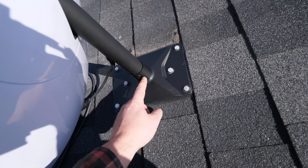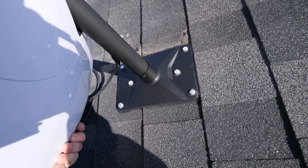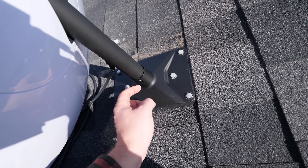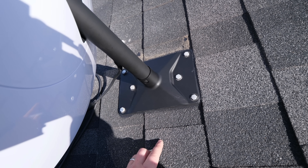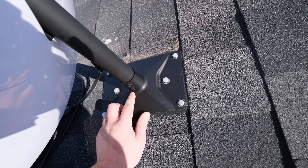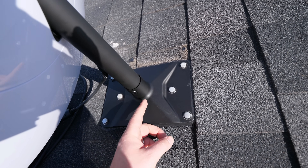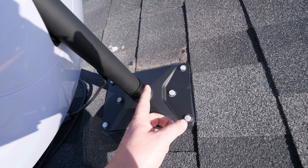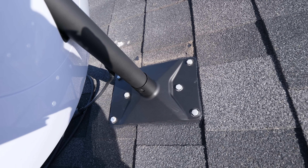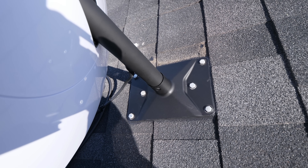So what I'm going to do is take the tube out, wrap it in tape, and hopefully take up some of this void and stop it from bouncing. If that doesn't work I'll just drill a hole from this side to this side and run a bolt through the whole thing to secure it. If I was engineering this, I would have the quick connect lower, put a notch on each side, then a clamp around it with a bolt running through it — so once you put the quick connect in you just tighten up the bolt and you'd be good to go. Elon, if you want to take that idea, just remember me and send me a check please.